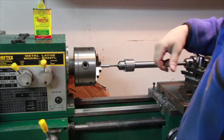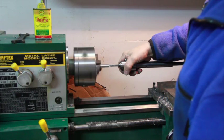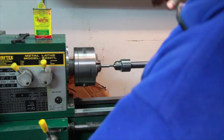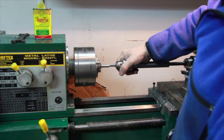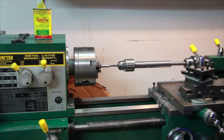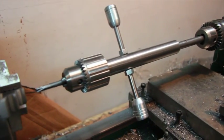I've got the lathe on the slowest setting, on forward speed. Since it's spring-loaded, I pull it back a bit and turn the lathe on. When I feel it catch, I just let it go, stop it, reverse it, and turn it on. There you go — threads tapped.